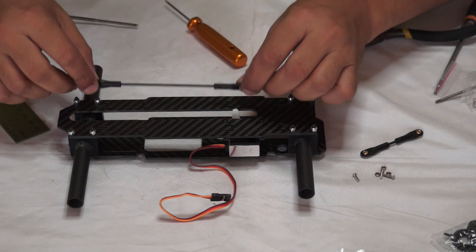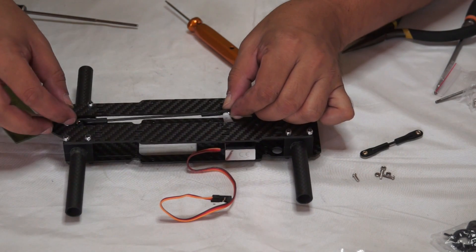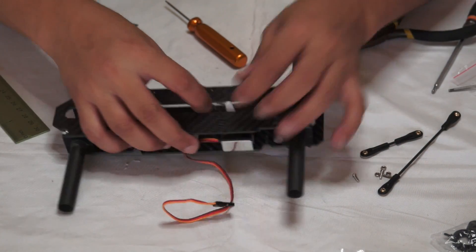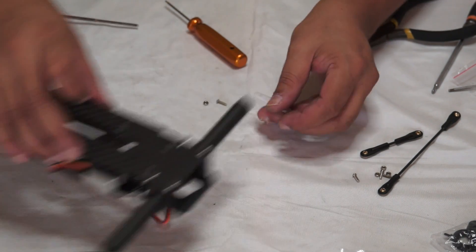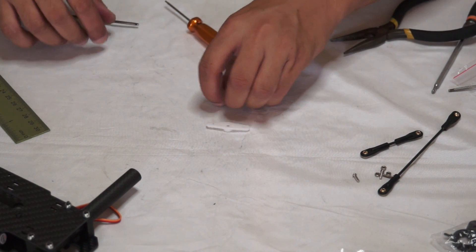This is still longer so let me tighten it a bit more - you may have to tighten them all the way in and then align them nice and good. Now let's do the rear one - align the rear arm's rocker piece straight perpendicular and check the length. Both connecting rods are now equal length - the perfect length we wanted. Now comes the tricky part: first remove the servo arm and let's prepare the connecting rods on the servo arm first.